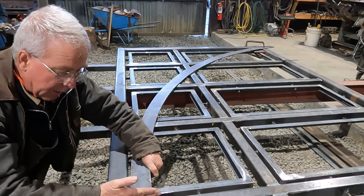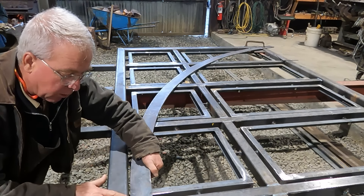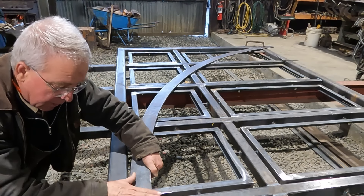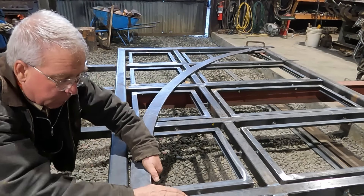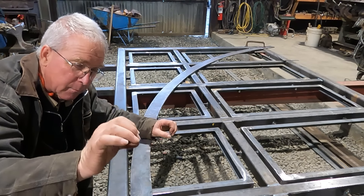The curve is fair. I've got these cuts so when I bevel them there'll be room for a nice tight root pass, getting a hundred percent penetration all the way across. There's going to be a rivet right through the middle of that tube and through the middle of each of the other tubes. Everything's laying in here flat, or will be by the time I clamp it up. But I'm not ready to do that yet — I've got a lot of work to do down in these corners, riveting the bottom of this thing.